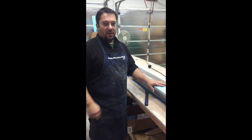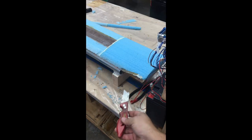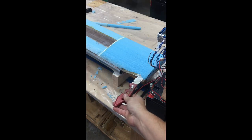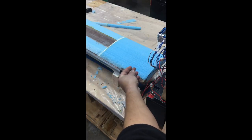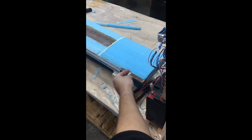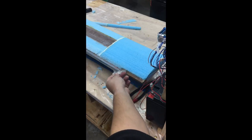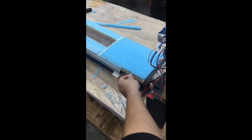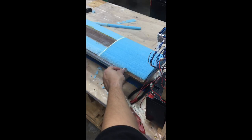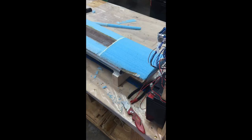So I've been working at this for the best part of an hour trying to grab a hold of the peel ply. You can see the peel ply here with some epoxy on top. Luckily I've been able to rip out this much — you can see it's got a really nice surface underneath, ready for secondary bond. What I'm going to try to do now is see if I can rip it all the way to the end. That's going to save us a lot of work. Let's give it a try.